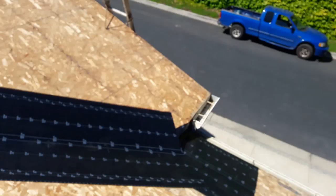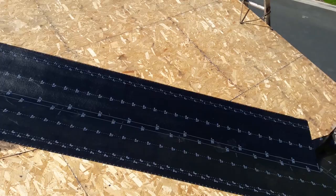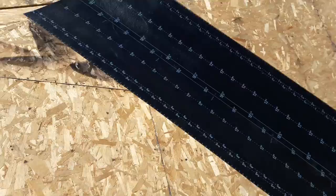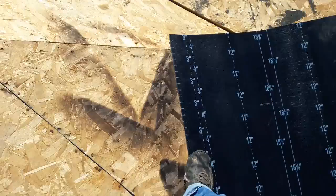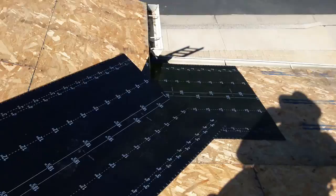Before I start doing my cricket, I have to waterproof the valley because the valley is connected with the cricket. I run a peel-and-stick on the valley underneath the underlayment — not on top of the metal, not on top of anything — I run it on the plywood. What this does is stick to the plywood, so if you have a water leak it runs here, goes around on top of the valley, and then runs underneath the valley and connects.